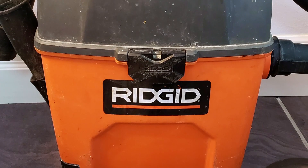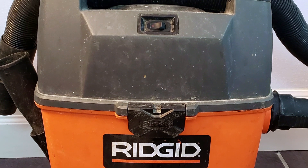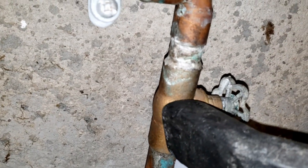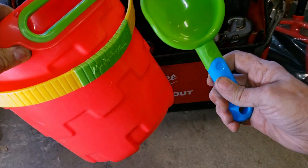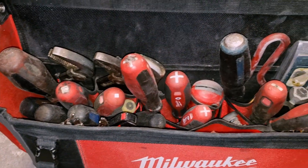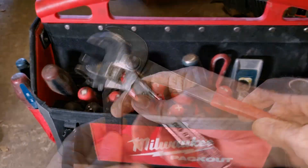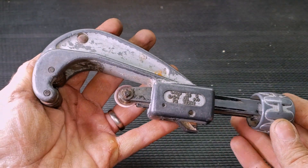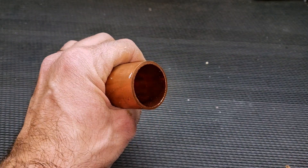You may also need a wet and dry vacuum to suck out all the residual water from the lines, otherwise the slightest trickle of water will cool your pipe and prevent you from soldering — highly recommended as it will save you a world of frustration. A small bucket or container to catch the residual water when draining the system. And an assortment of general hand tools including no less than at least one pair of pliers and a small adjustable open end wrench. You may also want access to a copper pipe cutter and reaming tool in the event you need to modify the existing piping.